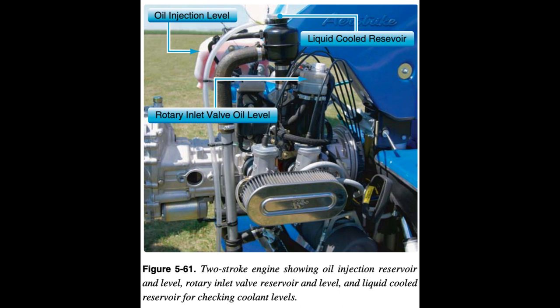2. Remove ground chocks and secure in aircraft. 3. Locate a suitable area to start engine that is free of dirt and has minimal dust, preferably a paved or grassy area away from people and objects. 4. Position aircraft so prop blast is clear, verify that brakes are on, throttle is closed, and propeller area is cleared. 5. Position into wind, if possible, for best cooling during warm-up.